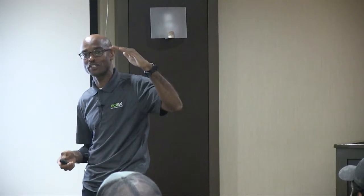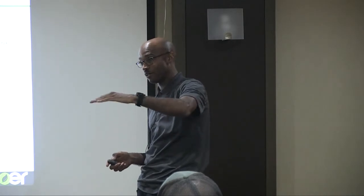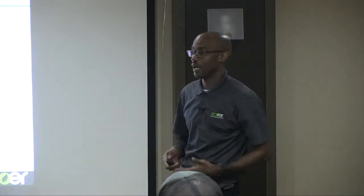How about as a technician, if we walk up to a unit and we don't have that stuff, what's going to tell us what the issue is? LEDs? Oh yeah, I'm going to get into that. On the unit, there's an LED, and you can actually check every single thing on the product. On that LED, you'll have the last three error codes, right? So you'll have the current error code, the one before that, and the one before that. So you'll be able to have some history on what happened.